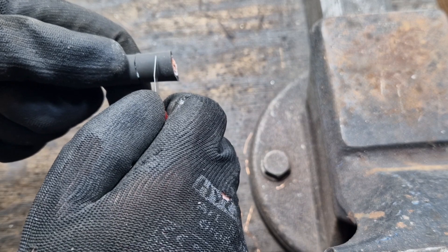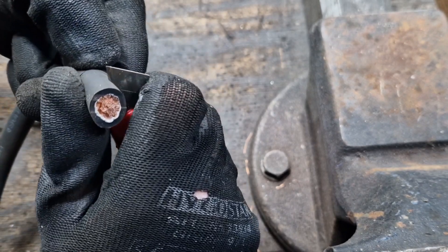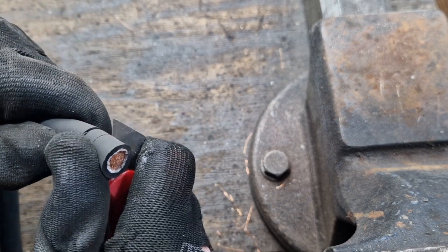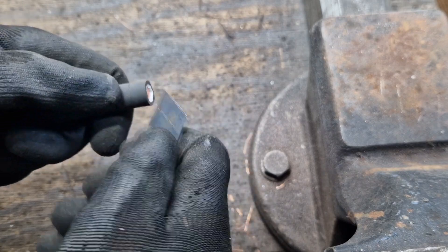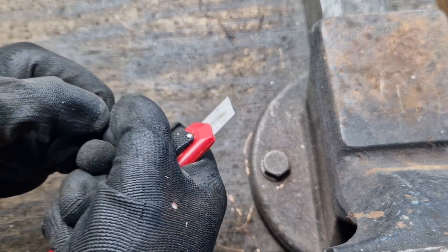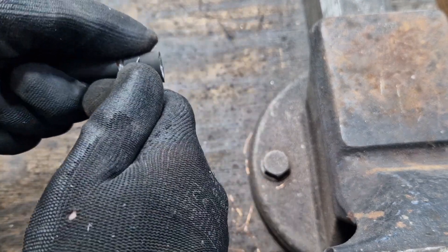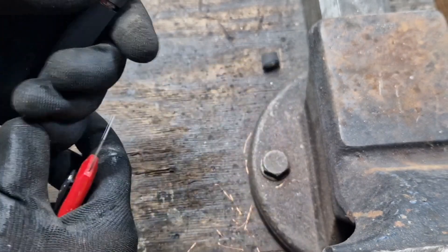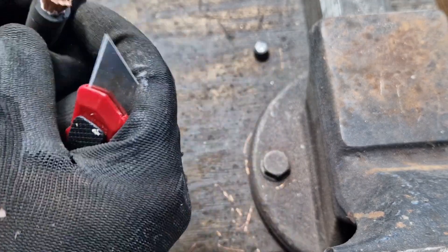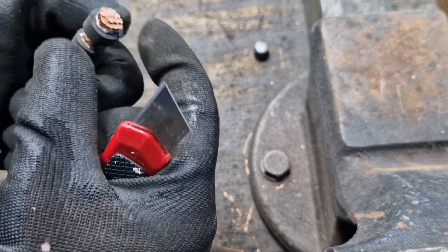Now here's the trick: you simply split the whole bundle of strands in half, then take off the top half. The lower half is essentially there for the purpose of properly fitting the cable lug over it. So we can properly fit our cable lug over the strands — I'm going to push this up here, and then we have everything nicely fixed.